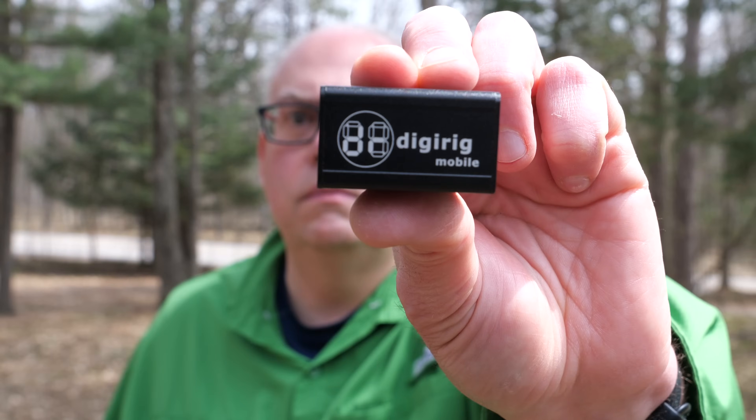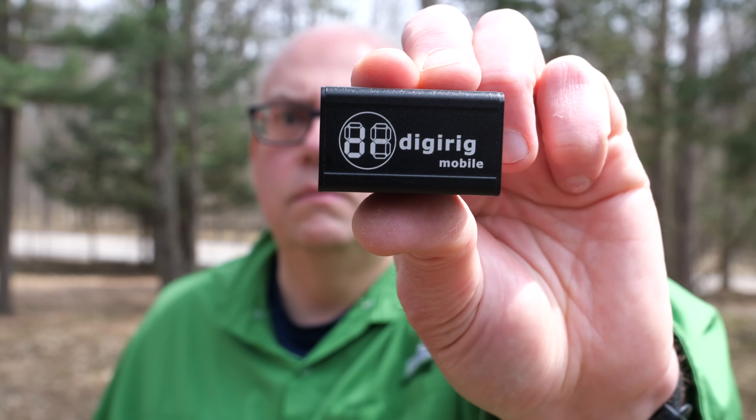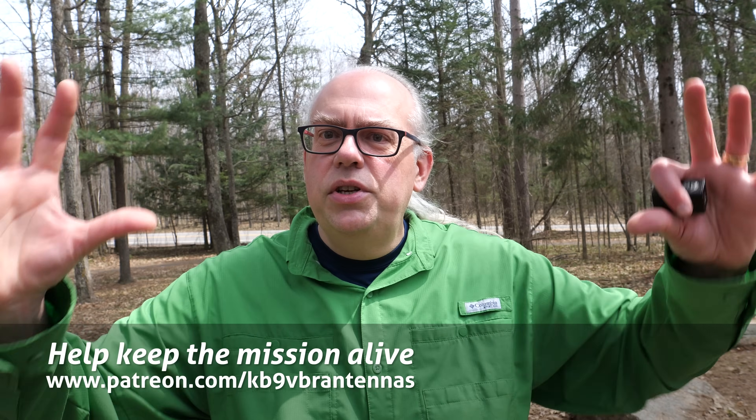Let's get into the reason I'm here — this little thing. I'm not really much into digital operation. When I'm doing a parks on the air activation, it's usually on phone. It's not really a lack of wanting to do it. I've had a Signalink for many years and used it on my old ICOM HF transceiver — it worked great. But every time I took it out into the field with my FT-891, the CAT control would always get flaky. Never really good results. Part of it was me, part of it the device, part of it the FT-891 — just a Venn diagram of failure.